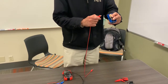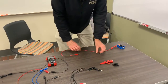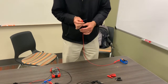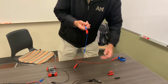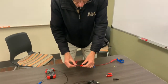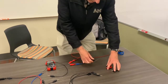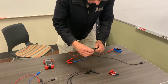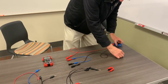The copper top of the battery is where the high voltage is. I'm going to connect an alligator clip to the high voltage, then connect the 110 ohm resistor with another alligator clip. I'll take one of my short wires with alligator clips on both ends, making sure the metal is making good contact out of the banana plug. Connect to the wire, then connect the 220 ohm resistor. One more wire goes back to the battery — final connection — and now I have built a series circuit.